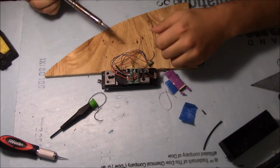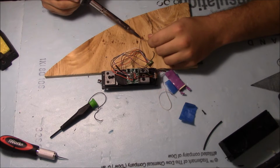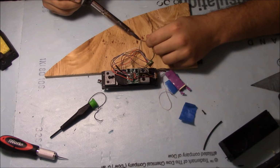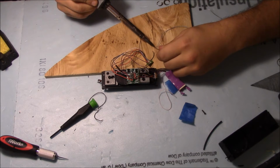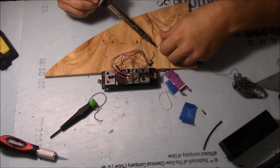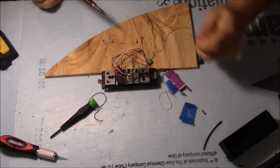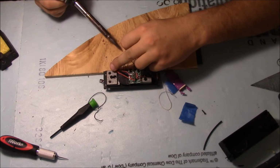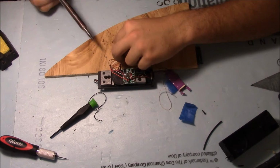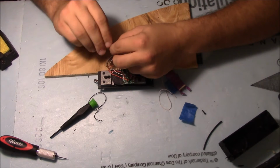Alright, we'll take our soldering iron here and tin up this wire. Tin up each one of these wires. We're going to tin up 3 on this blue one. So what you're going to tin here is the 2 blue sections that you've cut off of the function common on your decoder, and you're also going to do the one on the blue wire on the KA2.